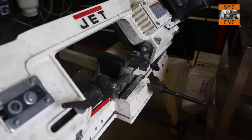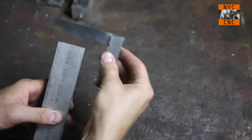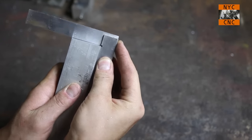Why else did I like this saw? The Ryobi crapped out on me — I needed something with more continuous duty that I could cut straight for a few hours. And my bandsaw — I love my bandsaw — but that aluminum cut on the DeWalt took about 20 seconds. On my bandsaw, it took three minutes and 38 seconds. Maybe my bandsaw has a little too much spring pressure not causing it to downfeed aggressively enough, but big, big difference. And looking at the cuts, the DeWalt cut is pretty darn square while the bandsaw cut has some angle to it.